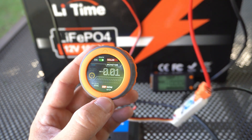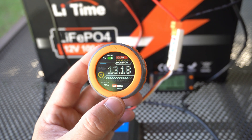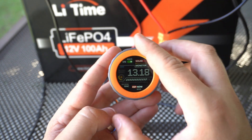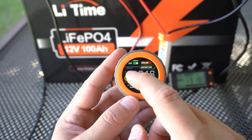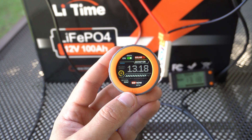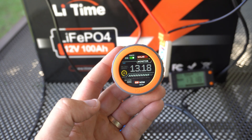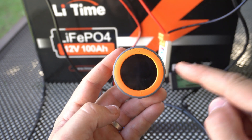I will connect my voltmeter module and we can see that the voltage is 13.80. The value can also be shown on the remote display — I need to increase brightness because we are outside. You will see this blue line which indicates when the board will go to sleep. When I touch something, the board will not go to sleep, but if I leave it for 10 seconds to save power, it will go to sleep.